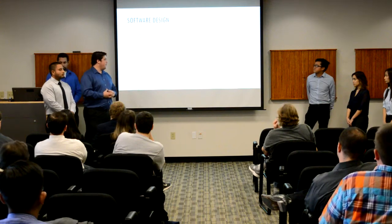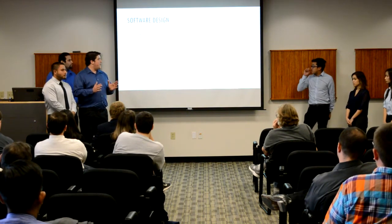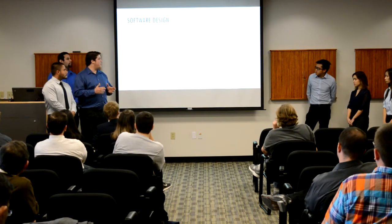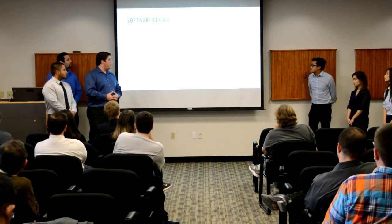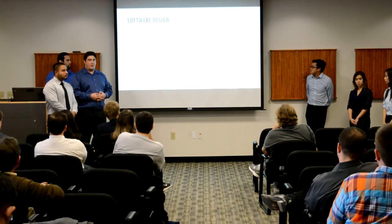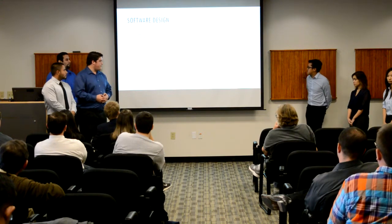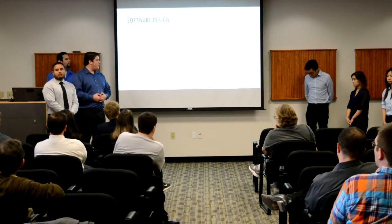Next, we have the 2 front proximity sensors, and if they both detect the opponent, that means they're directly in front of us in line. We can go ahead and move forward and increase our speed to try to push them out of the ring. Then we have 2 sensors on all sides, the left, right, and back, and with those we can rotate appropriately and get them into our line of sight, and once again push them out. And then with our default, if none of the other sensors detects the opponent, we'll be in our roam state.